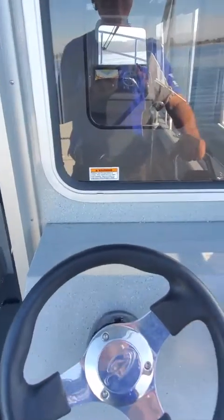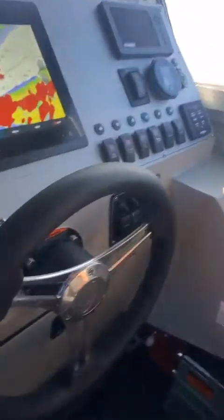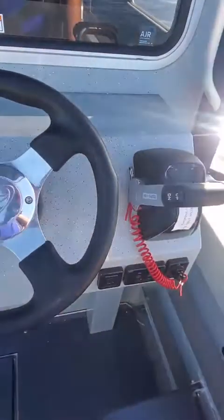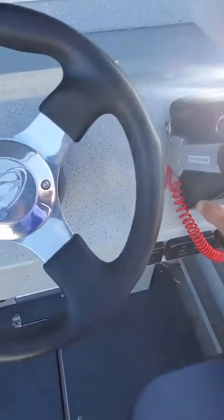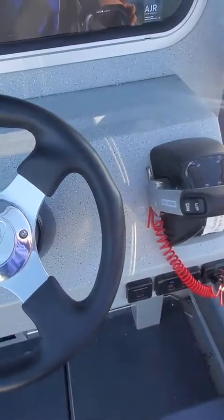Now, that's got to be a neutral up front for these to work. You hit the selector switch, and then you have to have the key on, because if you don't have the key on, it ain't gonna work. So you gotta have that turned on. And then you can hit the selector switch, start port. And then you hit this one in here like this. When these lights blue, they're right behind here. That means when you hit this, if it's flashing, you can put this in neutral. Or if that one's flashing, you can put that in neutral.